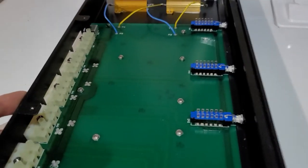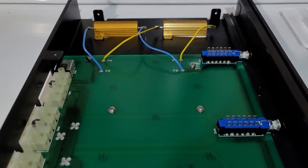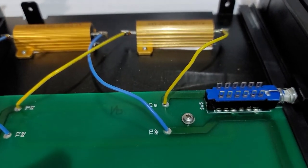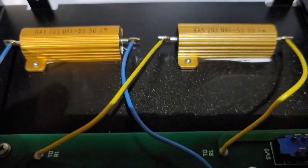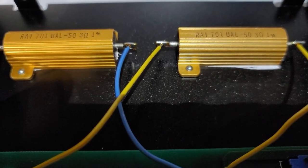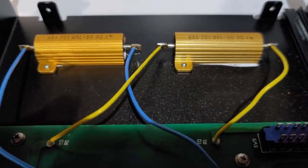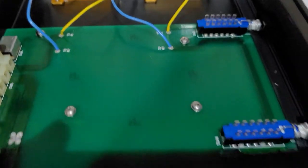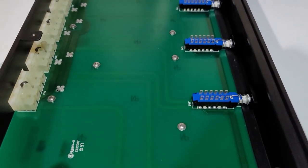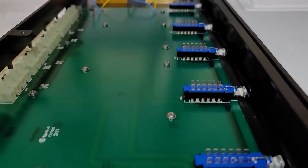I just had a need, particularly because the new Denon PMA1600NE amplifier has an A and a B speaker connection, but it has no switch. There again, here you see the 3-ohm 1% resistors here in heat sinks to balance out any mismatch you have as you punch in the correct combination.